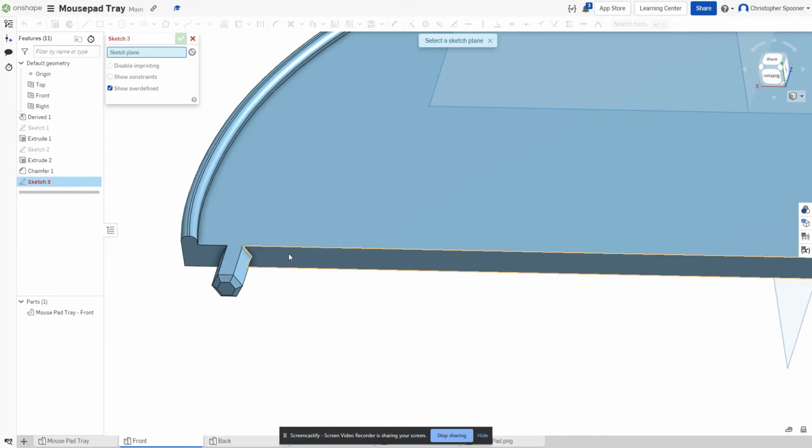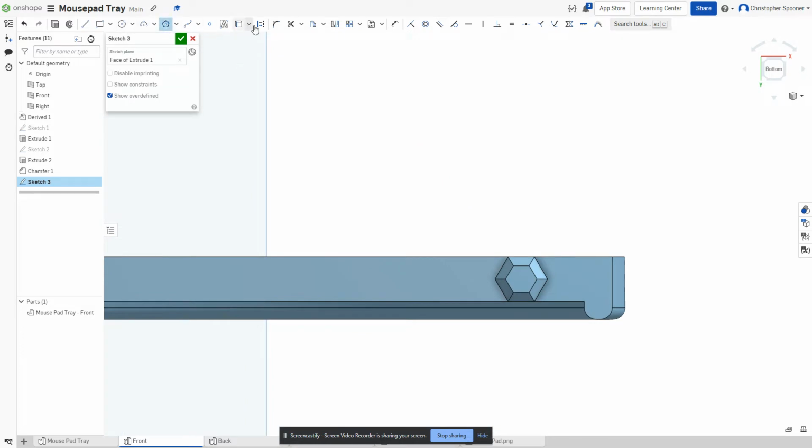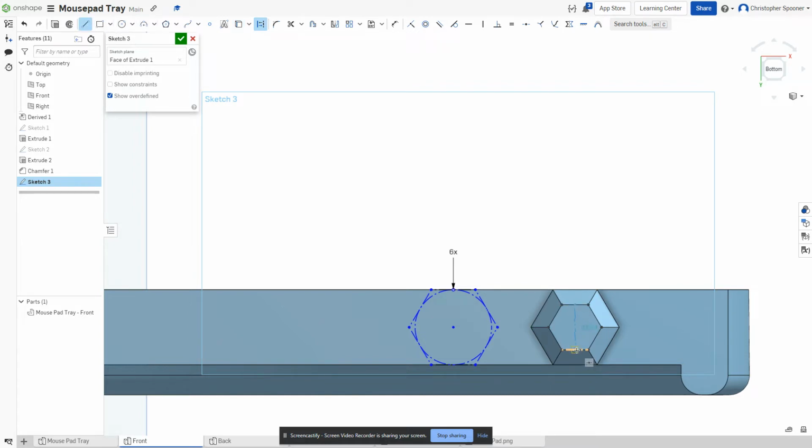Now let's build a female. So let's start a sketch on here, and then I guess I'll just leave it upside down because it doesn't really matter. This time I'm going to use construction mode to draw this guy. And there we go. And now we're going to lock him just like we locked the other one to the two sides. So this can't move, it just moves back and forth. I'm going to project as a construction this line here and put a line down the middle of him. I don't know why all my parts are male, but I'll fix it one day. So this to here. And I typically use 0.375, which is half of 0.75, which is the spacing I typically do. I found it works well. So if it's not broken, why fix it?